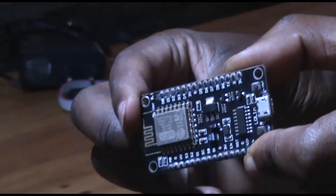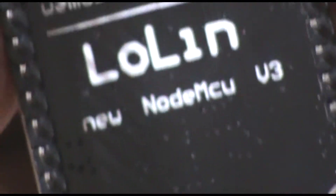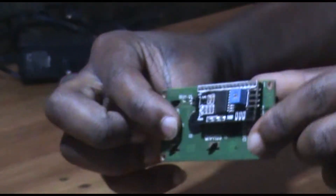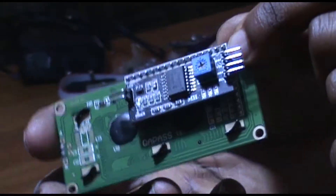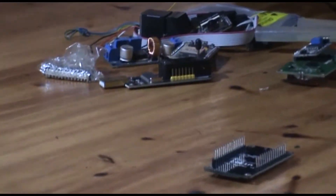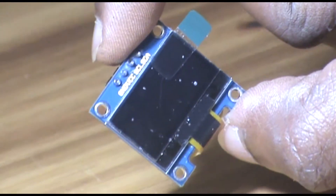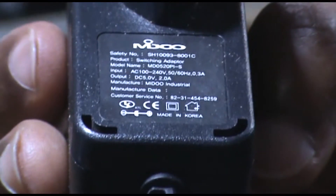We are using an ESP8266 Wi-Fi Node MCU version 3, but don't worry because the system runs on lower versions as well. I was thinking of using an LCD display with an I2C bus, but this wasn't a good idea because I wanted user fingers to be displayed on the screen. Therefore I preferred using an OLED display which has an I2C bus as well. The last component is the DC adapter — in my case a 5 volt adapter with a maximum current of 2 amperes.